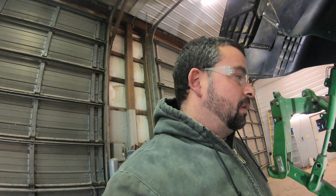I do have to clean the surfaces up. Use brake cleaner to make sure any oil that is on them is off, because oil will not let it set up and then we'll have leaks. So, cleaned up. There's a ring here that goes over the planetaries. I cleaned up the surfaces on that. I just need to rinse it off with brake cleaner. I need to do the surface on the final drive housing, and when I get back with the bolts, I will go back together. We'll see how well that goes. That'll be the hard part, I believe.